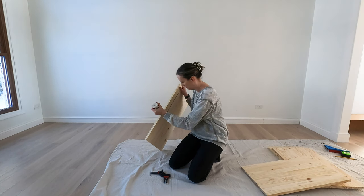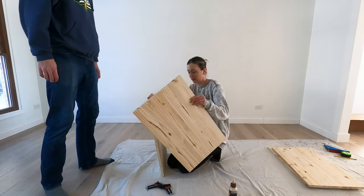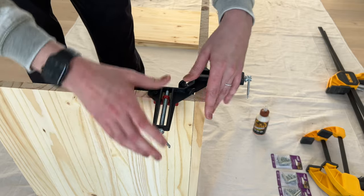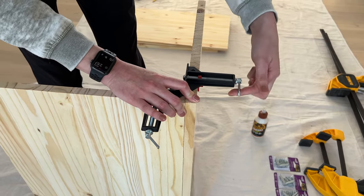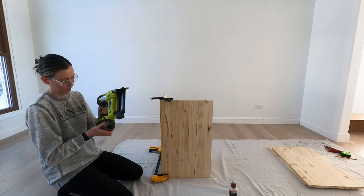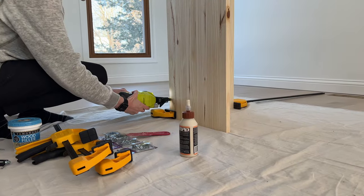Off camera, we did end up trimming down the fatter 1x16 plant pedestal — we took off about 9 inches so that these both had varied heights. Definitely not necessary, but if you're doing a set of two, it might be nice to have the varied heights. Starting off the assembly by applying wood glue liberally to the first edge. Then I'm going to use a combination of clamps and corner clamps to line up the corner before I go in with the brad nails. I'm shooting four brad nails into each side. We'll have all of the products we use linked in the description below for reference.